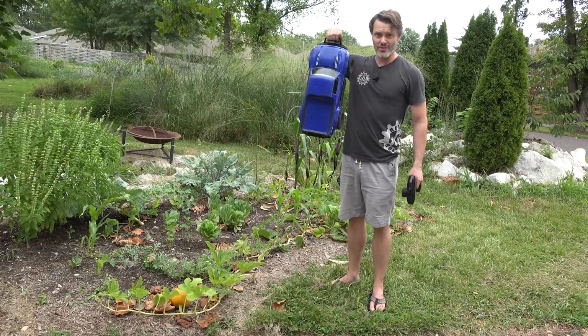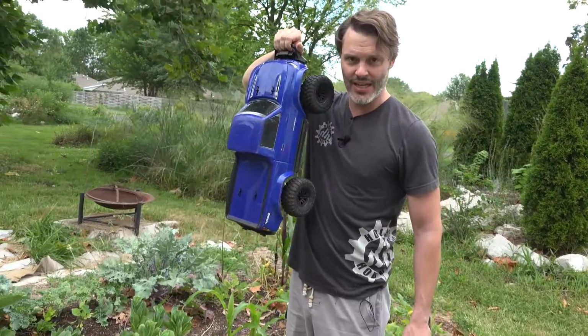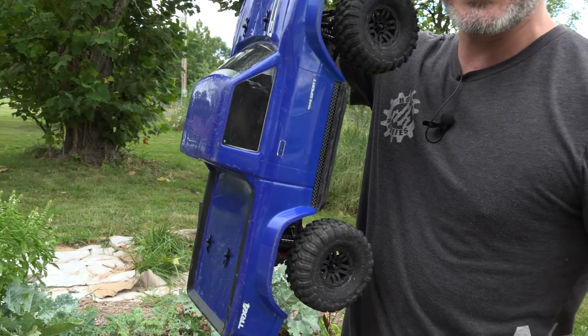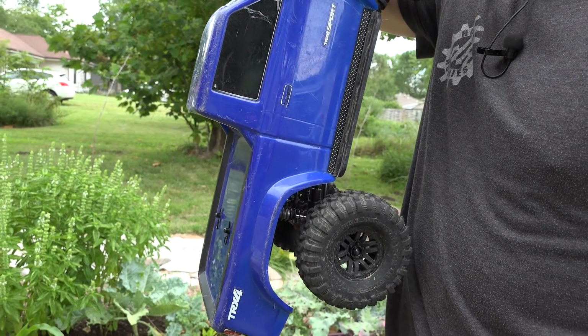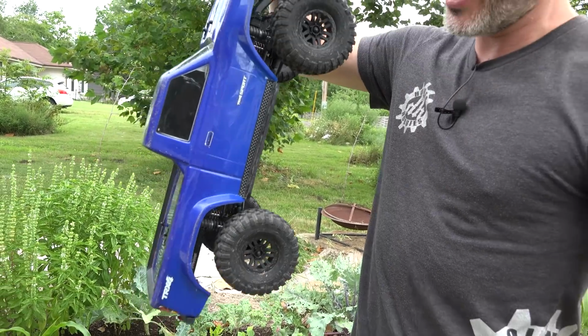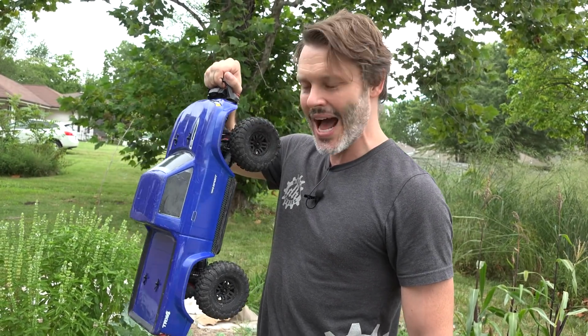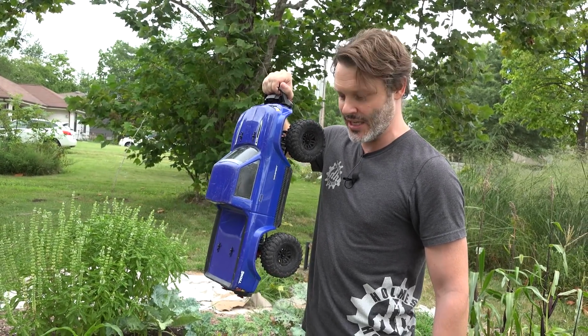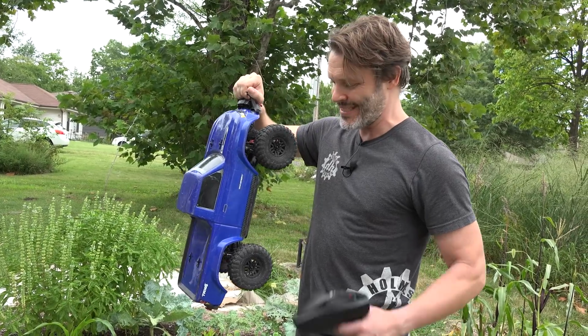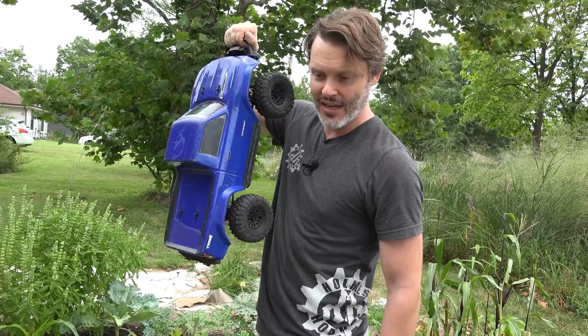Now, one thing I would like to note, unloaded, this transmission has a little bit of backlash. It has metal gears, and you can hear probably, since this prototype motor has a much lower mass of rotor, you can actually hear it smacking against the gears. And some FOC systems actually do that. This is technically not FOC, but it acts like FOC, and the universal nature means that sometimes, without tuning at least, unloaded, it may make some noise like that.